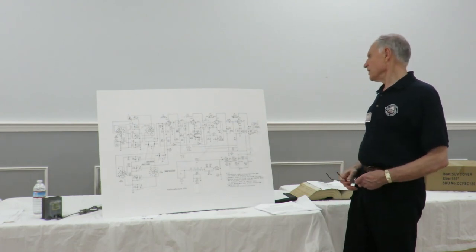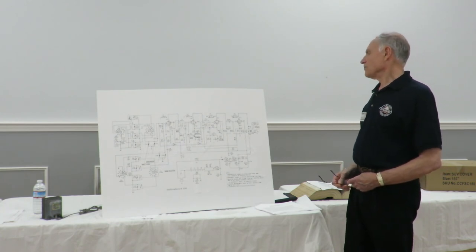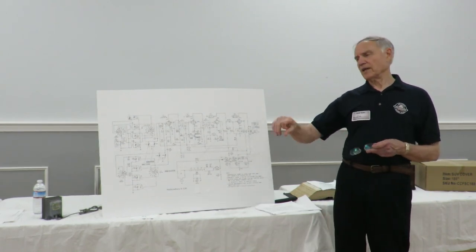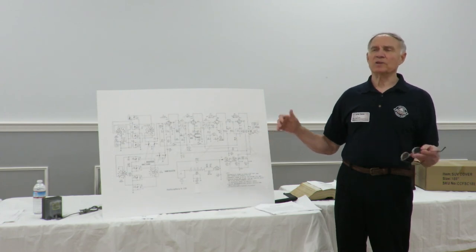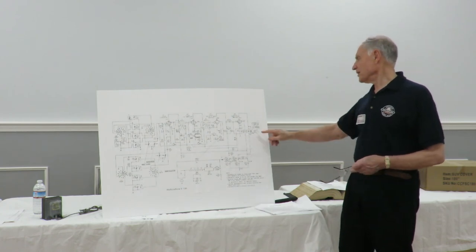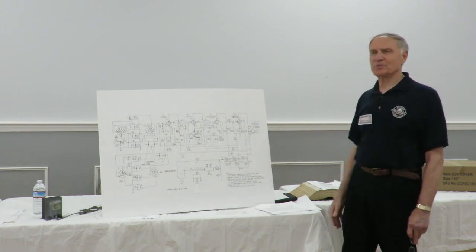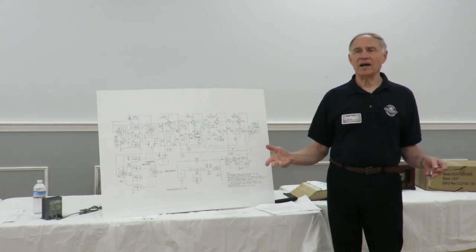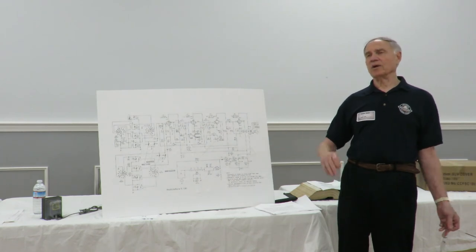I think most of these, this one doesn't have it. Now the older radios, if they had the plug in and you disconnect the plug, then you're going to disconnect the B plus on the tube and it's not going to cause any problem. If you don't have a speaker hooked up to this thing, typically they put a resistor in here so if there is some load and the speaker comes off, but you can't disconnect the speaker on this thing anyway. I've operated a radio without a speaker and I haven't had any damage to it. Now, I haven't run it for 12 days that way at maximum volume.